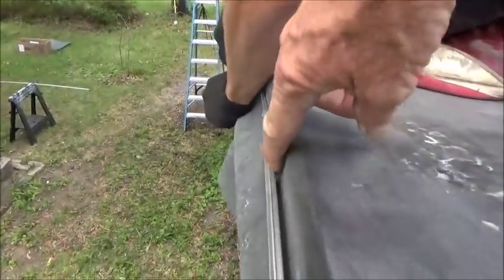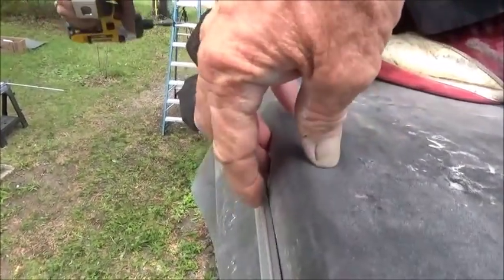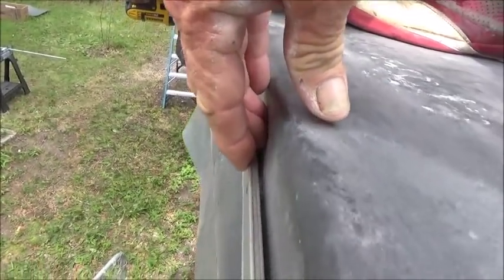The last step is — most people don't see it because I haven't put it on video — caulking that top of the termination bar. You don't want water going behind the screw, so caulking is what the lip is for.